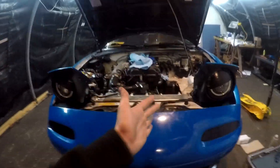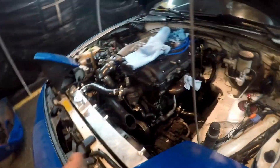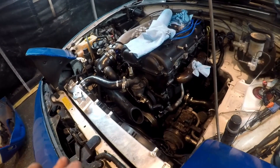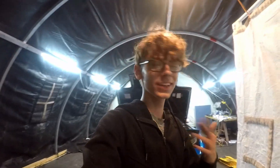If you do all that you're going to get a really good turbo manifold for really cheap. It took me about five days, which is slower than it could have been, but I learned a lot. It's welded inside and out on both flanges to make sure it doesn't leak. I leak-tested it — hooking an air compressor up and spraying soapy water, not seeing any bubbles. Just be careful, it can crack, so you may not save money in the end — but you know the ins and outs of it so you can always re-weld it and learn as you go.